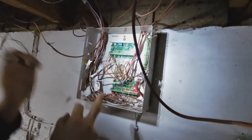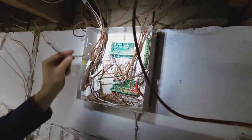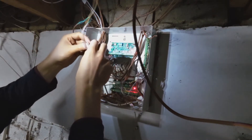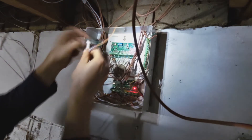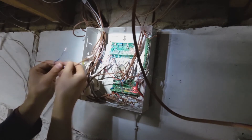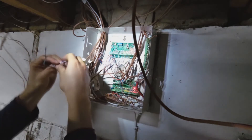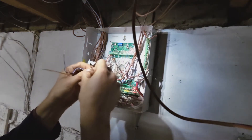Due to space limitations on my other expanders, I've had to extend the smoke detector wire through to another expander — that part of my alarm is full. I'm labeling it as 'smoke detector.' The white and blue wires are the signal wires. The red and black I've already connected to power, but the signal wire still needs to be connected to the open zone.